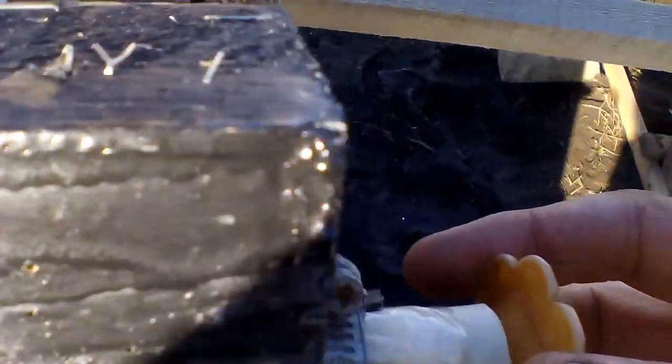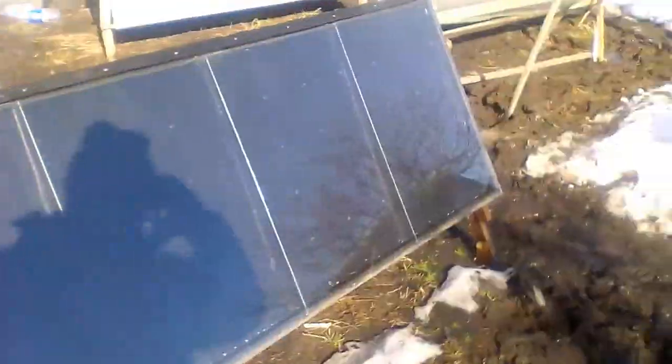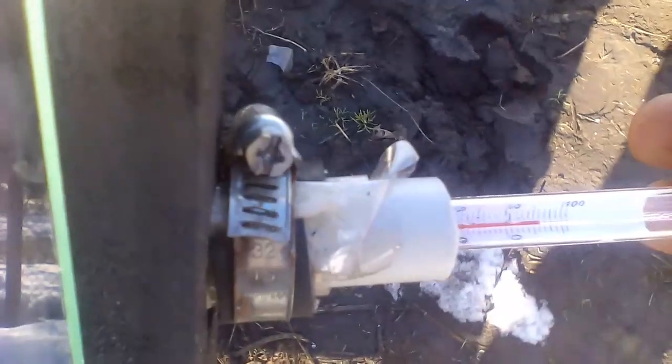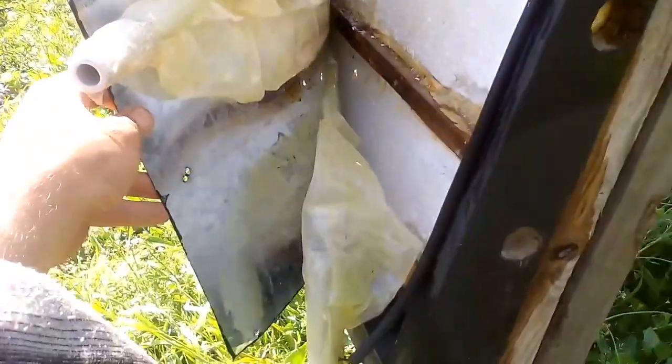This is one of my experiments, and we can notice that now the water does not circulate through my solar collector, but I filled those sleeves of the collector with about 15 liters of water this morning, and we see that the sun has already heated the water to about 95 degrees Celsius, and now the ambient temperature is 3 degrees Celsius above zero. Shadows tell us that the sun's rays fall on the plane of the collector at an angle of about 20 degrees because noon was more than an hour ago. Now the heating of the water has stopped, and this phenomenon is called stagnation of a solar collector, and those 95 degrees are not dangerous for materials of my collector. Now I am showing the results of other tests of stagnation of my solar collector, and these two polyethylene sleeves more than a dozen times have been at a stagnation temperature greater than 100 degrees Celsius when the sleeves were not filled with water.